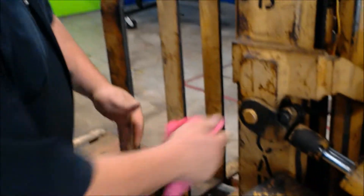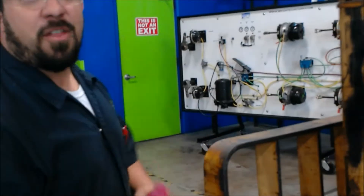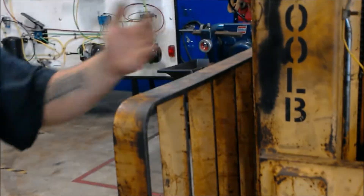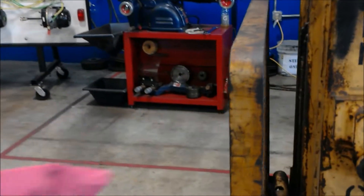You want to keep it all loaded. You want to make sure our bolts are tight, not bent, cracked, or broken. You want to look at the frame of the forklift and make sure the frame is intact — there are no cracks, it's not bent or broken.